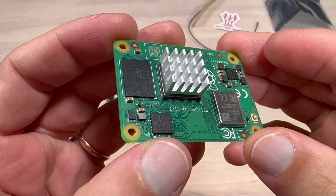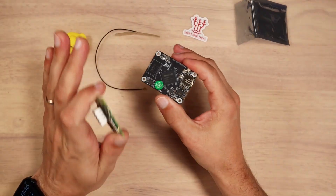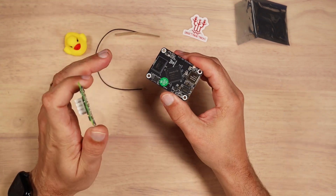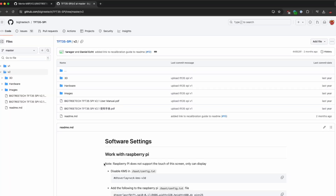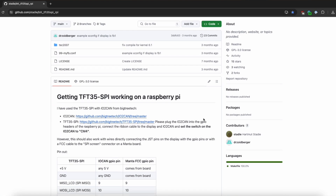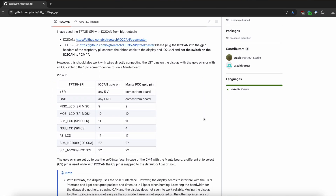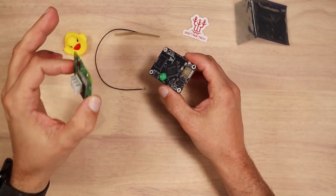However, if we compare it to Raspberry Pi, the community and overall support plays a huge role in the use of the CM4 model. The main downside of using the Raspberry Pi CM4 with Manta series boards was the lack of Bigtree Tech Serial TFT support, which a few months ago was actually solved. I found a GitHub repository by Steady, who made a decent manual on how to fix this issue for Raspberry Pi — the link will be in the description.